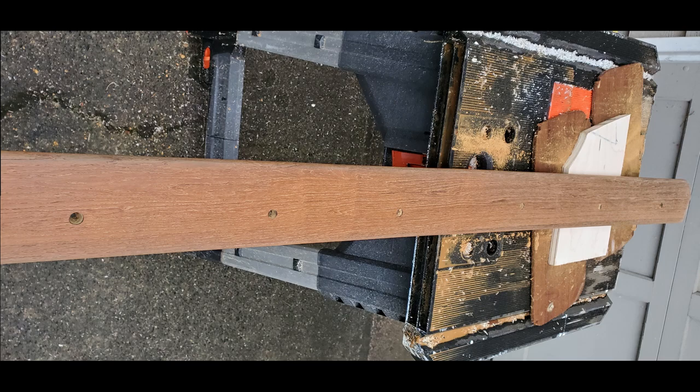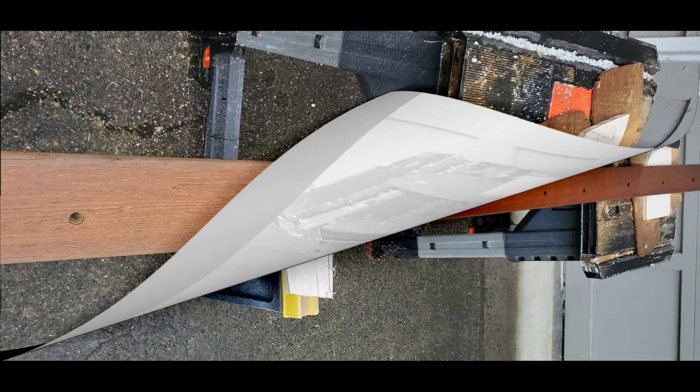One of the important steps about varnishing is the pre-work before the preparation. Cleaning and wiping down to make sure there's no dust on it is one of the key elements to coming out with a nice, clean, clear finish with no imperfections in it.